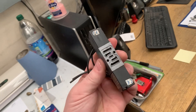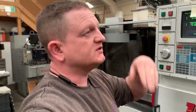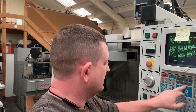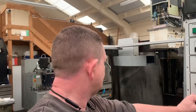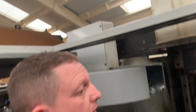It turns out there was actually nothing wrong with this solenoid. I mentioned previously there's an air leak — I could hear a large amount of air depending on what gear. Whether it was in high gear, you had a small air leak; if it was in low gear, you could hear a bigger air leak. Currently we're in high gear. If I go MDI, I think it's M41 — right, we're now in low gear and there's a small air leak.